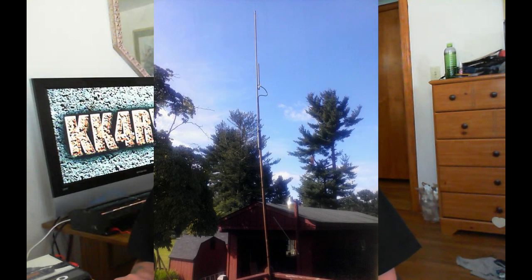My antenna that I currently have is a homebrew J-pole, and that one's not tuned for the 440 band, so I haven't really messed with higher outputs. But on the 2 meter band with just that antenna in this radio on 50 watts, I can hit repeaters on the other side of the mountain that I live on, about 50-60 miles away, and still make the repeater and sound well. So I think, given the circumstances and the conditions, great.